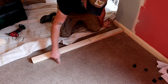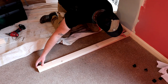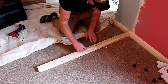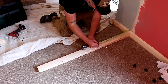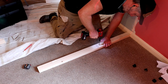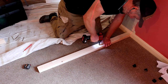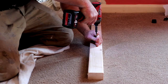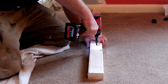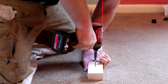I can then offer that up to my laser line — difficult to see in this shot but it is there. This is going to help me keep the two separate wall frames either side of the door opening in line with each other. I'm marking up where the floor joist is so I know where to add a fixing, and I'm screwing right through the carpet. I know I'll probably get some hate for not cutting the carpet away first, but honestly I didn't see any good reason to — the screws are going right into the joists so this is plenty secure enough, and when the time comes to replace the carpet I can just cut it away then.